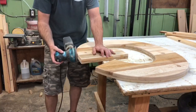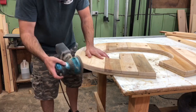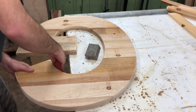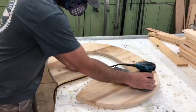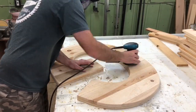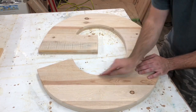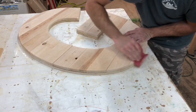There probably will be some imperfections around the edge. Just grab a sander and smooth out as much as you can. Obviously the sander won't fit on the inside, so you're going to have to do that the old-fashioned way — grab a piece of sandpaper and go to town. I typically use about 150 or 180 grit on this; it's kind of up to you. And then sand to your liking. Just want to make sure your round overs are nice and smooth on all your edges, and then go on the corners as well and round those over.